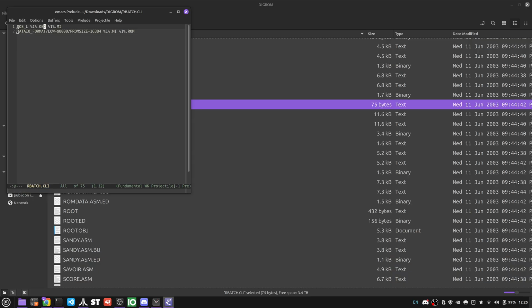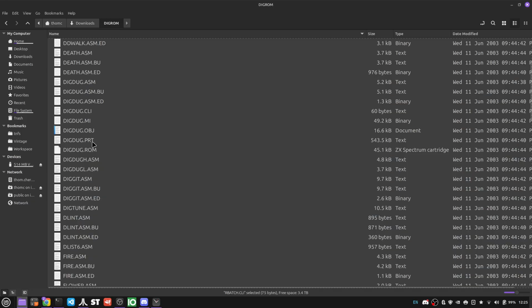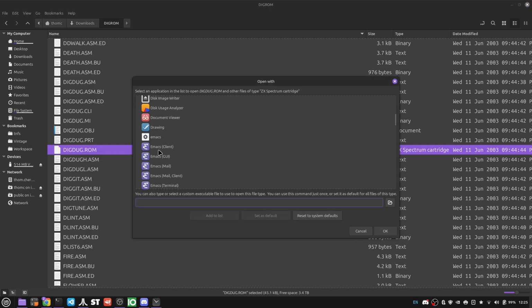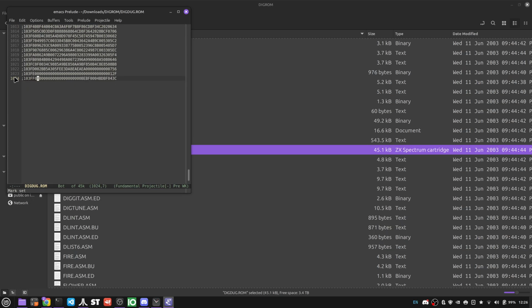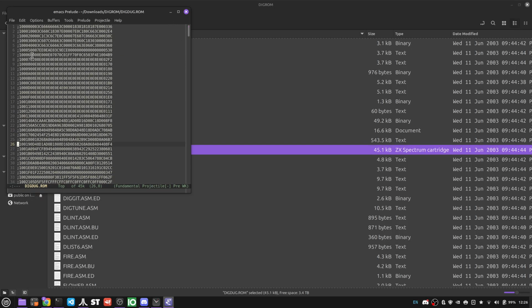Well, this is important because the result is then passed through, chopping off only the cartridge area here, making sure that it's exactly 16K, and putting the result into an Intel HEX format file that can be sent off to the EEPROM burner. And it looks like this. So you can see it starts here at address 0 and then goes all the way down to 3FFF, which is a 16K EEPROM. But this file right here can be directly taken and thrown into a PROM burner to burn the final PROM.